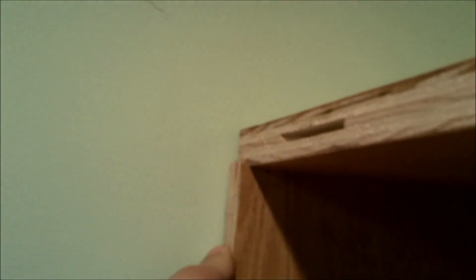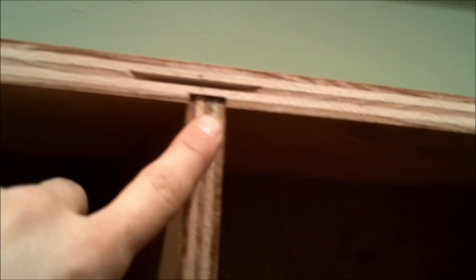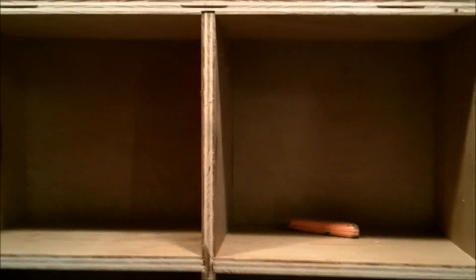There's one other thing I wanted to show you. This top piece — because the tops don't line up — that's kind of gross, that's kind of gross, and that's particularly gross. It's just my rough carpentry attitude making it not quite line up with anything. I decided to relieve the back of the board that goes there, and I cut the biscuits after I relieved the back. Now this thing notches in and will cover up all of my wrongness right there as it places in nice and tight. That means I'll have to relieve the backs of all the other pieces on the top work — so the verticals that come next and then the small horizontals that are covering up the bottom of the top shelf.